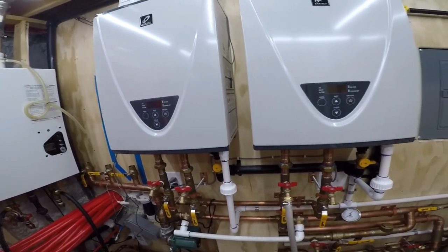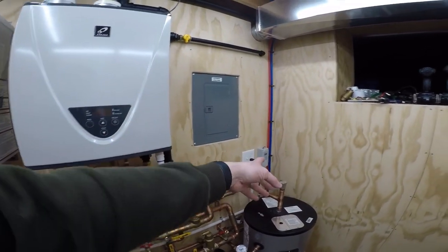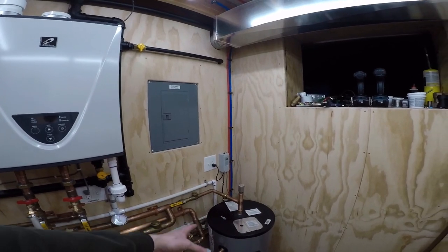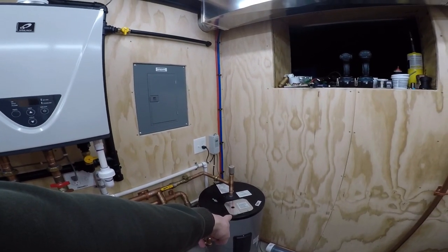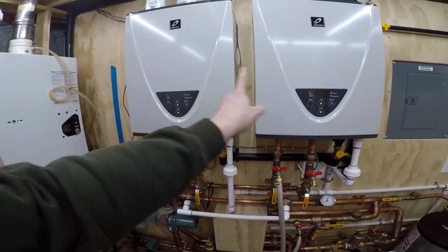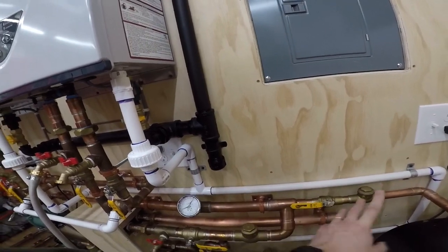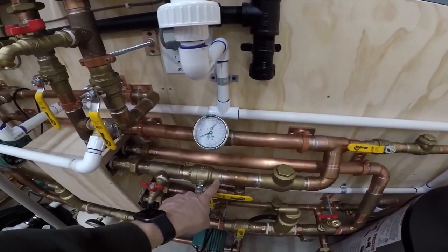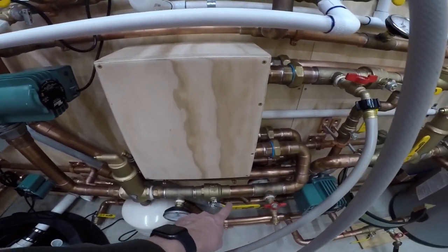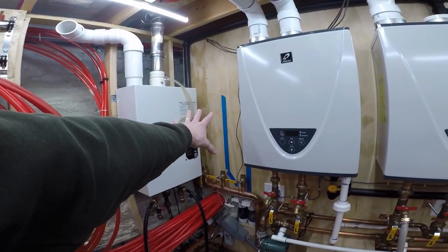Now I'm going to turn on the primary pump, which will be for the heating. The tank recirculation pump will come on when the aquastat for the tank gets low, and it'll run for whatever differential I set — a minute, two minutes, five minutes — we'll dial that in. That pump is just to recirculate the tank to bring it back up to temperature. This primary loop pump will be controlled by the heating side. It's going to circulate water through the heaters, out through the heat exchanger where hopefully my heating side sucks every BTU off of it, come out nice and cold, go through the pump, get heated again, and just keep going around and around.